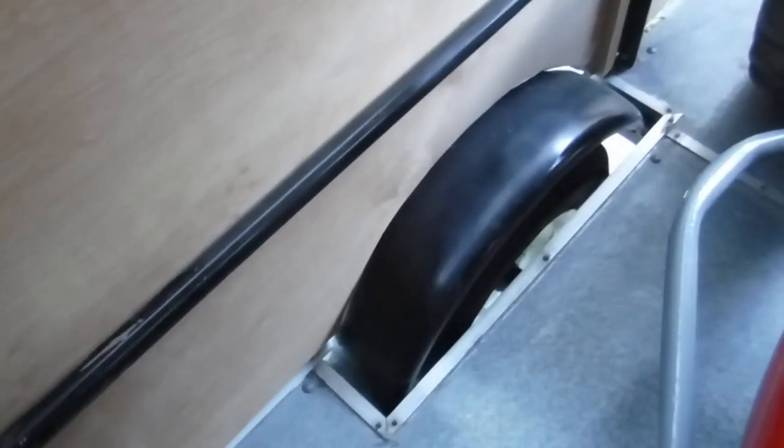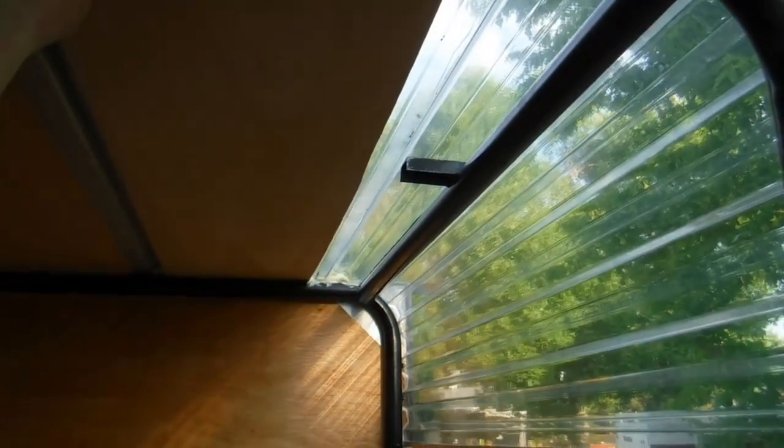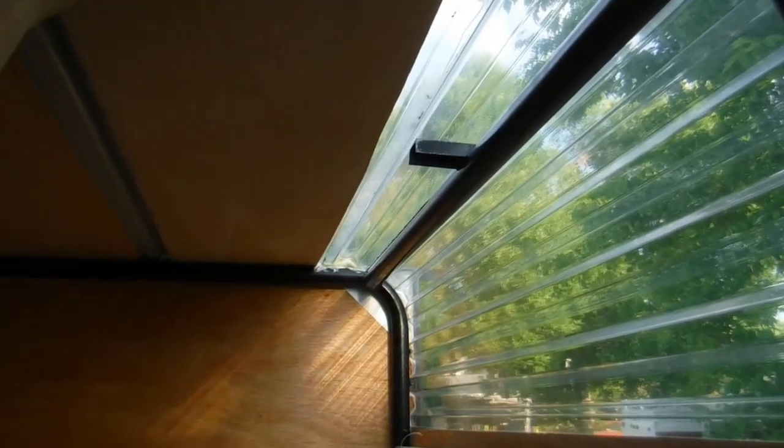Here are my wheel well covers for the inside — I haven't put those on yet. This is basically the crux of it: it all started off with this inch-and-a-half round tubing, which kind of made it unique. Most things you're going to find are going to have flat surfaces. A lot of RVs are made out of pine studs, very small — just like fur strips. They just staple the heck out of it and have a lot of layers; those layers give you strength. I use this on the inside so I wouldn't accidentally bang into it and make a dimple in the outside skin, and the same from the outside going in — giving it a little support so you can have a structure.